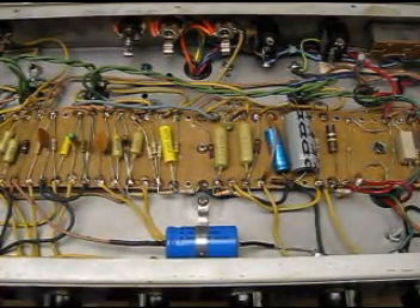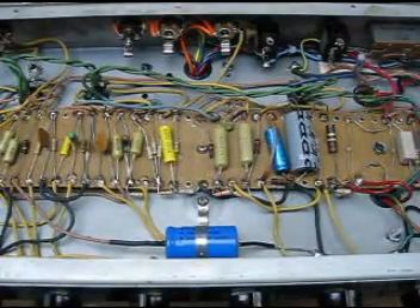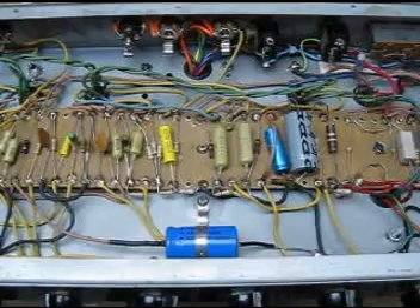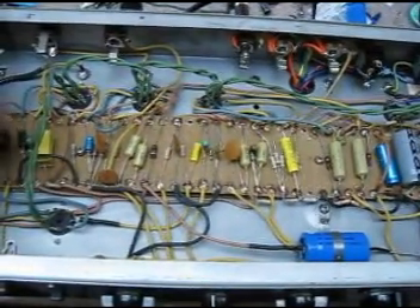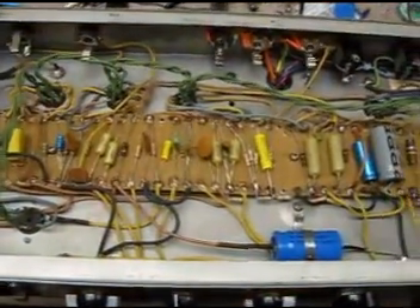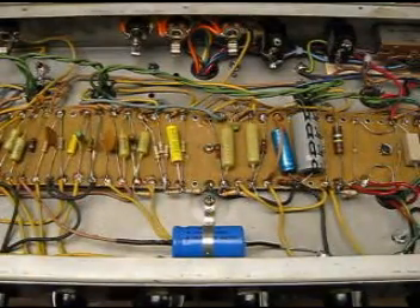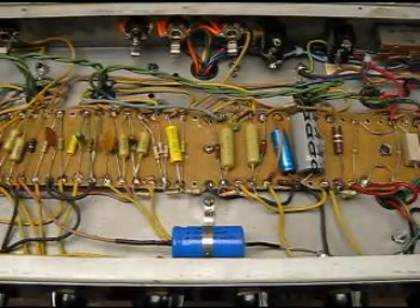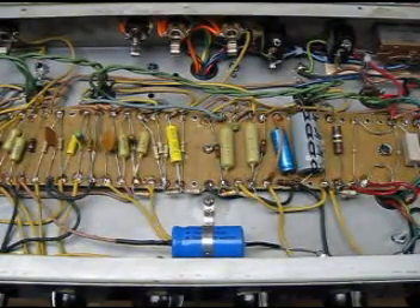It's not quite as loud and cutting as some of the other amps, for two reasons. The coupling cap up front actually restricts a little bit of gain, being a smaller coupling cap. And the lower amount of filtering allows it to throw a little less wattage at you, which is actually cool because then you don't need to attenuate the amp.